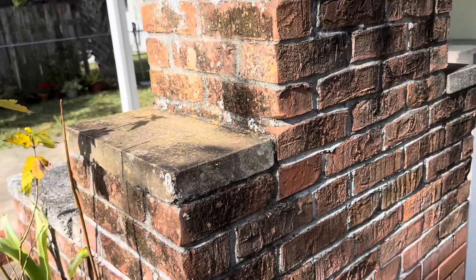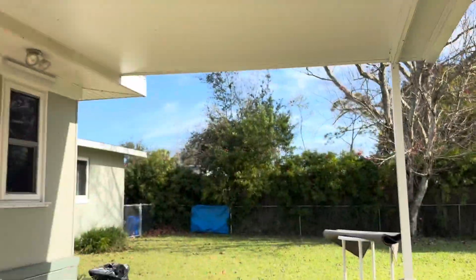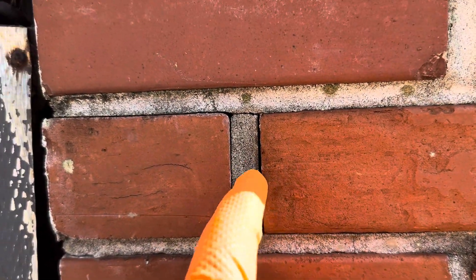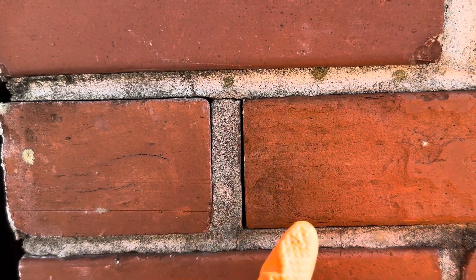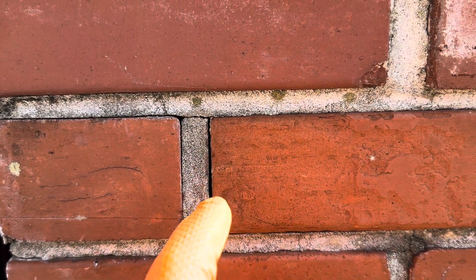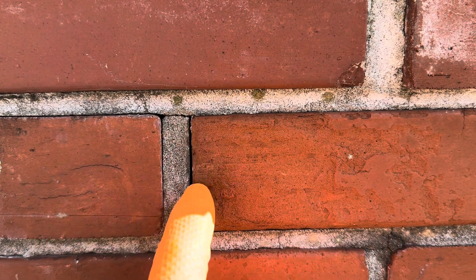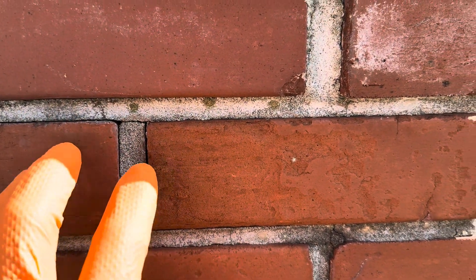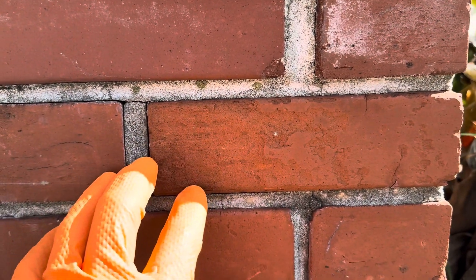This is another reason why a pump-up sprayer is great, because the four percent solution is just going to touch the surface of that. You really want a hot mix to burn that off — and that way it's one and done. Never use high pressure on any type of brick surface. The reason being is that inside a brick surface you're going to have mortar joints, and if that mortar is compromised you'll be pushing moisture in and behind there. On a house it's particularly important because you will get moisture behind those bricks and into the walls and create more mold and mildew than was there to begin with.